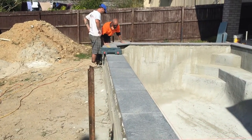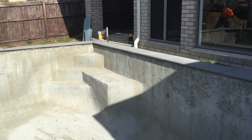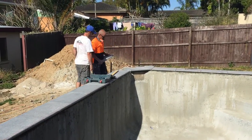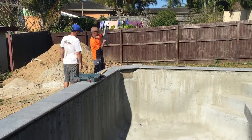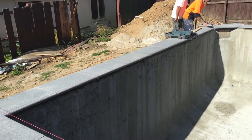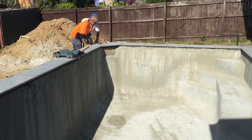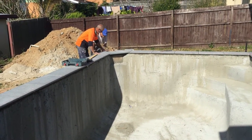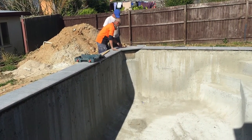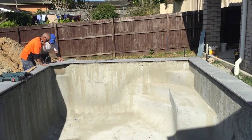At the moment we're laying the pavers and doing the skimmer works. With our pools, we always put the skimmer box in the corner at a 45-degree angle. What that does is help the circulation of the pool — you've got two walls, one end wall and one sidewall, leading into the skimmer box, so it gives you greater surface suction and a better cleaning action rather than the old style of having the skimmer box at one end in the middle, sticking out like a sore thumb.